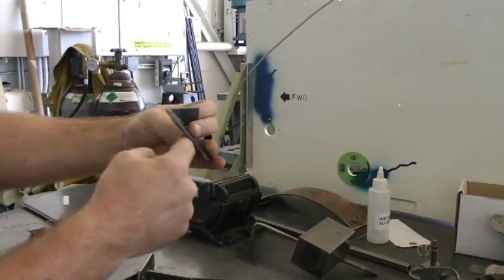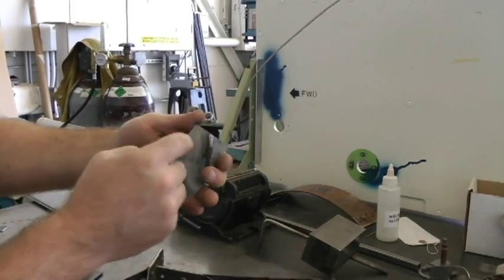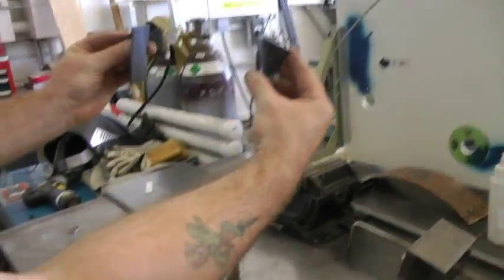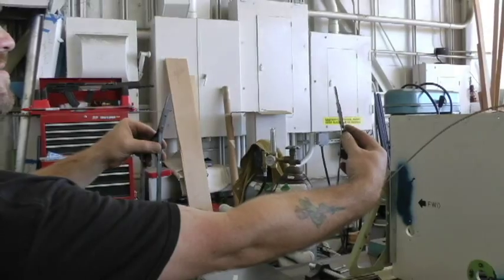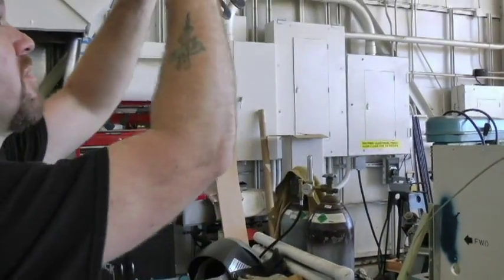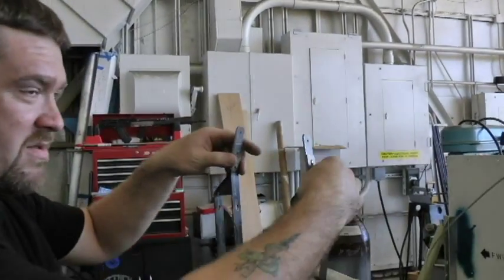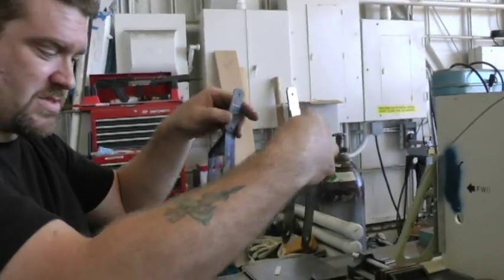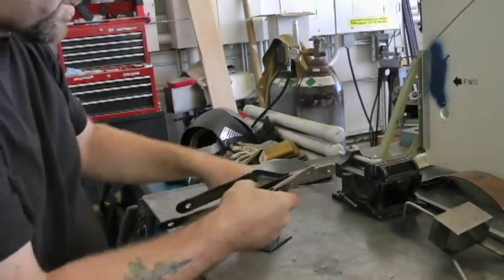They have a little piece of leather that goes here. They're not drilled up yet. But the sling comes off of those on each side of the aircraft, points backwards to a spreader bar. These are on the stabilizers like so, and the cables go up to a little spreader bar, to the forward attach points, and that's how you lift the tail around before you put it on the fuselage. Can you kind of show me where those go on the empennage right now?